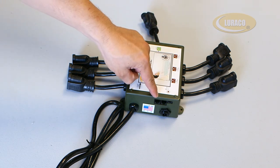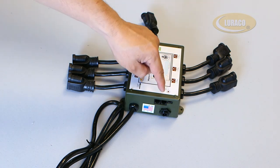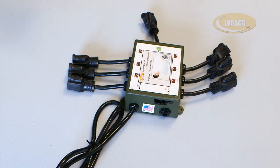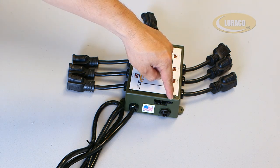This port connects to the LED light. This port connects to the control keypad. This port is called a slave control — it is a network control connection. This feature allows you to use multiple pumps in many large tubs but use only one control keypad. This port connects to a water level sensor, which prevents the jets from running dry and getting overheated.